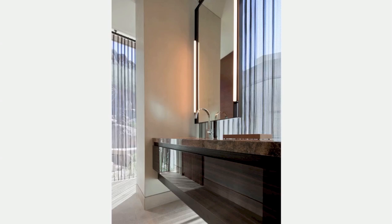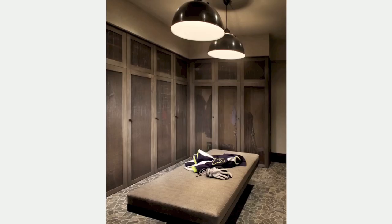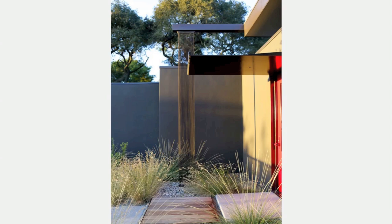We can use them as drapery. Hanging wire cloth like this modern twist on drapery can provide high levels of screening while preserving a visual lightness. Cascade Coil drapery makes some fantastic, beautiful products perfect for this application. Mesh can also be used as infill on doors. The mesh on these lockers is from TWP. It offers a more refined and rigid alternative to standard insect screening. The density of the weave affects how visible the contents behind the doors are when viewed from an angle. The openness also permits drying and airflow in this application. I could see this mesh being also used in a laundry door where airflow is equally important. Most of all, it allows you to be creative. Once you begin thinking about metal mesh and its potential, it's hard not to think of an area that it couldn't be used for in the home.